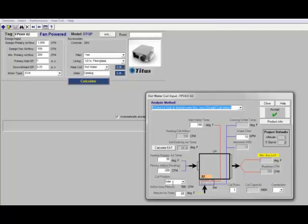The preferred position for a hot water reheat coil on a parallel box is on the induction port. On a series box, it always goes on the discharge of the unit. It's a little bit more efficient to pull the plenum air through the coil and then over the blower rather than push our cooling through that coil on the discharge of the unit.